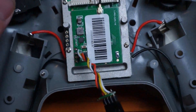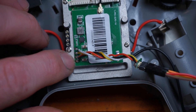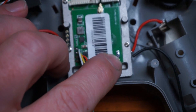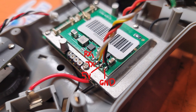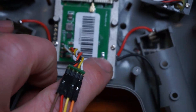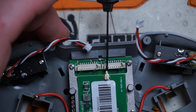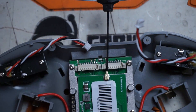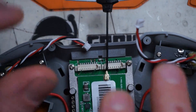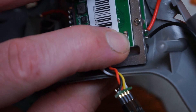Just so you can see the pin-out: white is RX, yellow is TX, red is five volts, and black is ground. This button here is our boot button. I'll put a still image with all this drawn out. Before we connect this to our PC we need to hold this boot button down. I also installed an antenna — out of an overabundance of caution I'm going to put one on. I had an extra BetaFPV 2.4 GHz antenna, so that's what I'm using. Hold the boot button down and connect the FTDI to the computer, then you can let go.